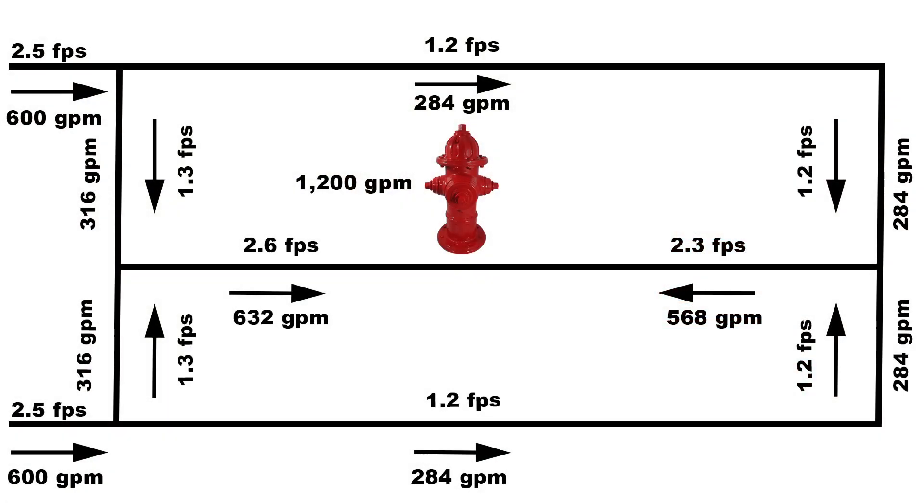Use this map to develop the plan as it is easier to visualize the whole system. Measuring pressure and flow while flushing the water distribution system allows operators to monitor their flushing and make sure they do not operate the system in a way that can damage the system or draw in contaminants. Monitoring will also allow the operator to verify that a desirable flushing velocity has been achieved while maintaining sufficient positive pressure in the system. Often, in order to maintain pressure or create an adequate flushing velocity, operators will have to close valves in the system to direct flow towards the section being flushed. In grid and loop systems it is easier to do this without disrupting water service to customers.